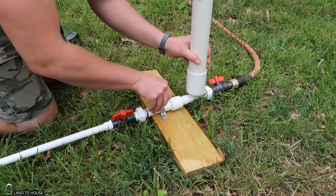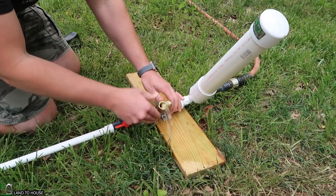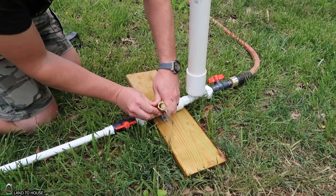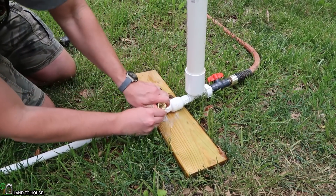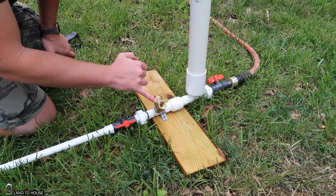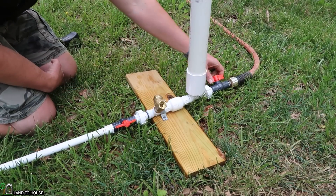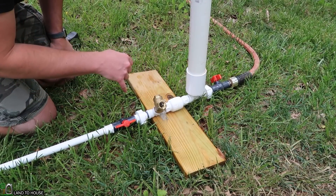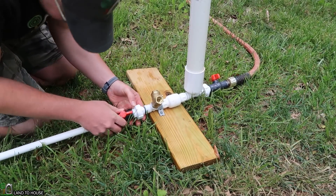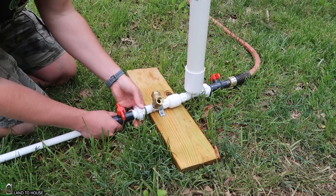So what can we do? You can actually tilt the waste valve over to the side. Turn the pressure tank back upright, move it like that. So now there is less force required to close that valve because it is already partially swung closed already. So let's see if we can get this to operate now. I've got a leak here — I think I've pinched my O-ring here.